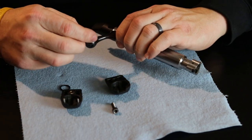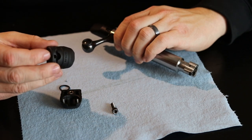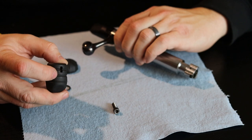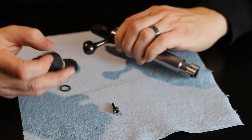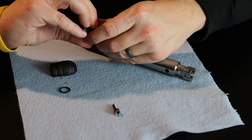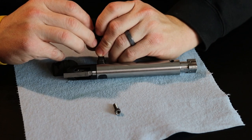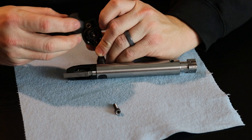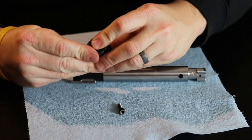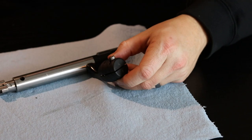What I do is take a rubber o-ring and put one on top, then take this piece — always putting the large Allen head insert to the back where you can't see it, so the front is just a little slit. I always make sure that's to the front. Take that top piece and set it on top there, then take the other half, flip it over, and put it on the other side. Those metal pegs you just want to match up between the two pieces. Once you get your two pieces together, start your Allen screw back in the hole and cinch it down.